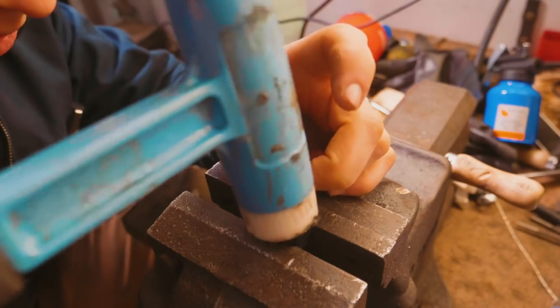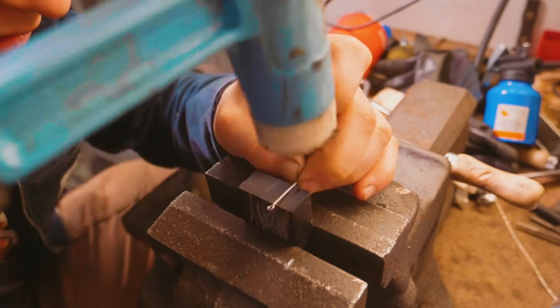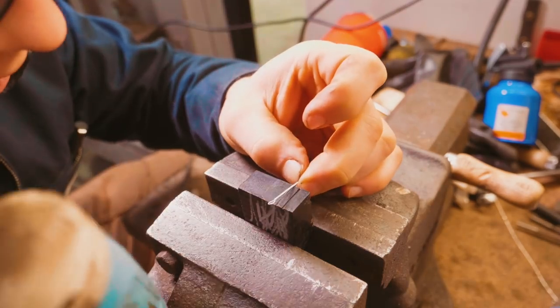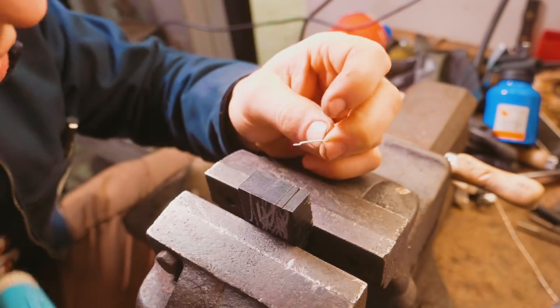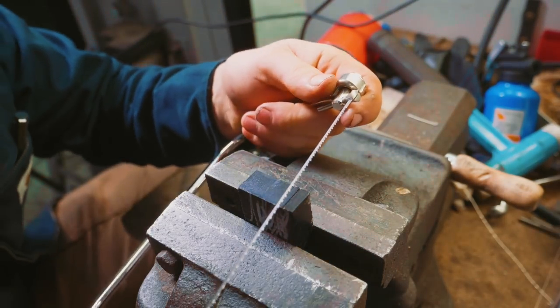It's tricky, it's gotta be just the right amount of press fit. Can't be so tight that I mush the silver in trying to install it, and you see how tight that is. There's just no chance that that silver would press in there. I have an idea. I wonder if I can surface grind a coping saw blade.